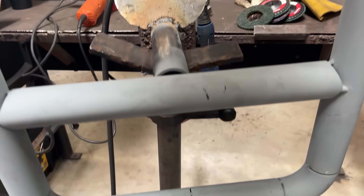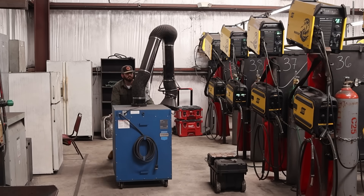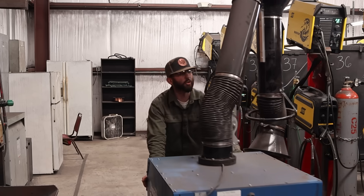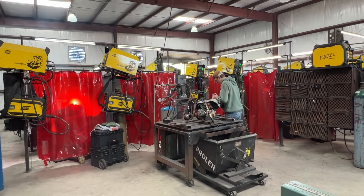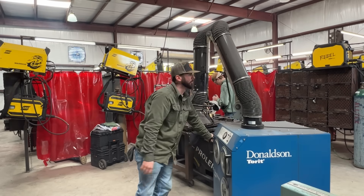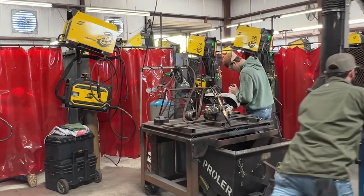We're also adding another element — we're going to be throwing a little bit of cold galv on today's project, because a lot of the handrails you'll face are galvanized. I didn't bring my personal respirator, so I'm pushing the Donaldson fume extractor over here so we don't fog anyone up — galvanized is pretty nasty. We're also running a self-shielded flux core process with no gas, which is pretty smoky. It all goes hand in hand with this field application.